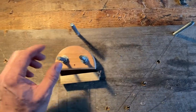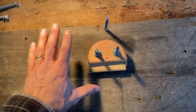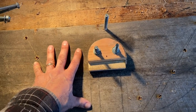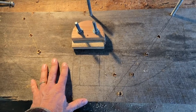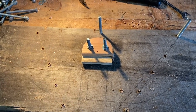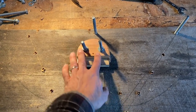You have to make sure that the center is the correct width for the bow that we made. You can put one pin on one side, because we're going to do this a little bit of an old-fashioned way. You can use all kinds of different machines and come-alongs, and those work great. But peg boards like this really seem to be the traditional way of making a bow. A lot of times if you went to an old barn, you'd see some of these peg boards on the side of a barn, bolted right to it — that's how they would make their bows, with interchangeable pieces in the center.